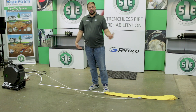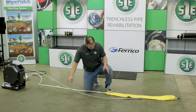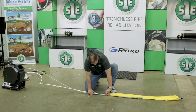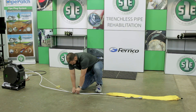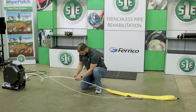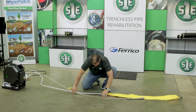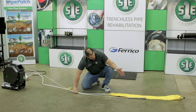The next thing we're going to want to do is transfer our measurement that we made with our push camera and put it over onto our system. Take your camera head — no matter where the mark is — center of your packer, and then you want to make sure that you keep the push hose and the camera relatively straight so that when you transfer the measurement, your mark doesn't change on you. Transfer that mark over. Make sure it's on there nice and tight — you don't want it to move or fall off. Double check everything. Your camera head should be about center on your packer.